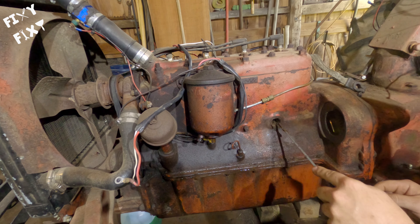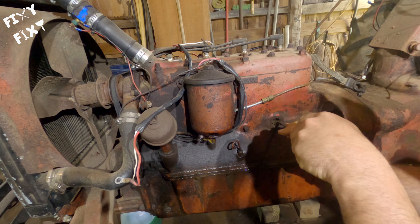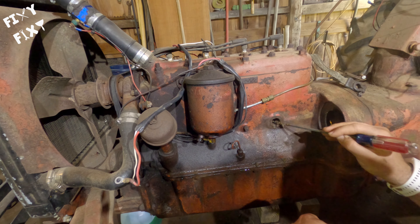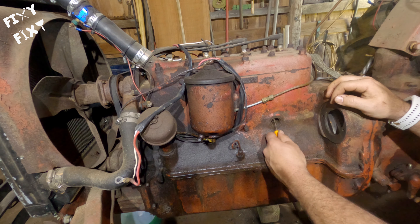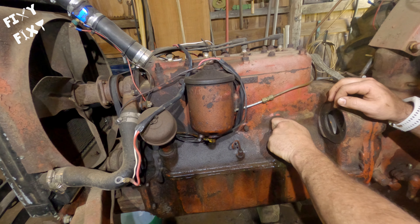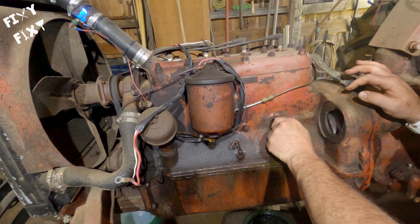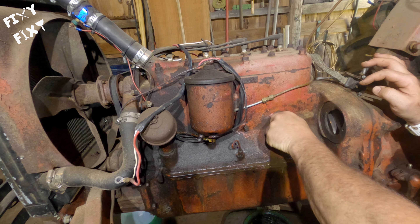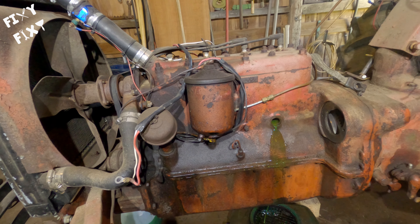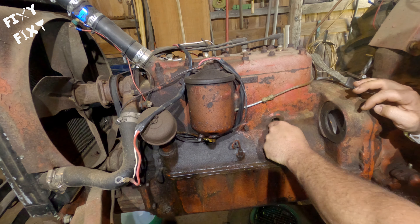Stepping into this project, I made sure I could get the plug caps I needed and started draining the radiator. I thought the big complication I was going to run into was going to be getting these caps back in right - you gotta hammer them flat, it's a whole thing. I never saw this coming. I just dug and dug and dug right there to where I ended up breaking through to the actual portion of the water jacket that wasn't consumed by packed dirt. I cleared that out as best I could using a number of different tools to remove as much debris as possible.